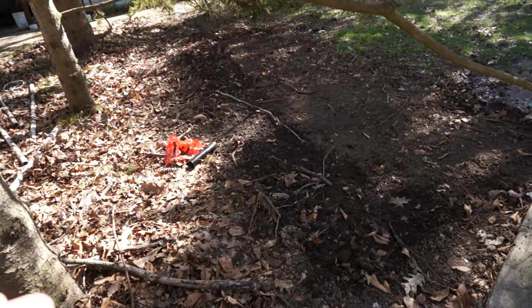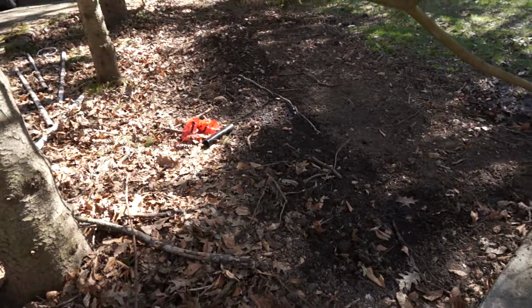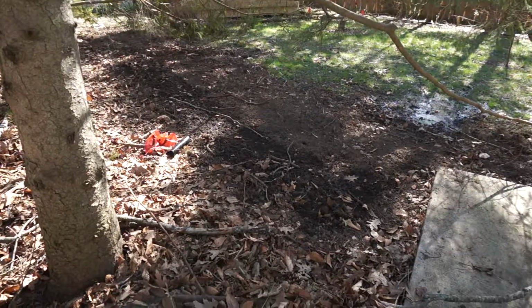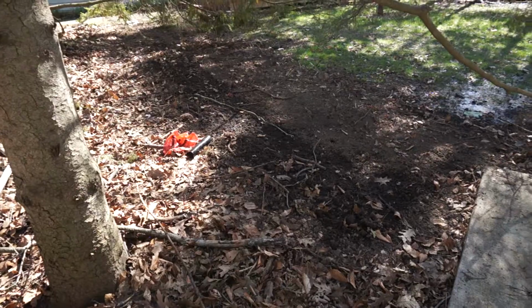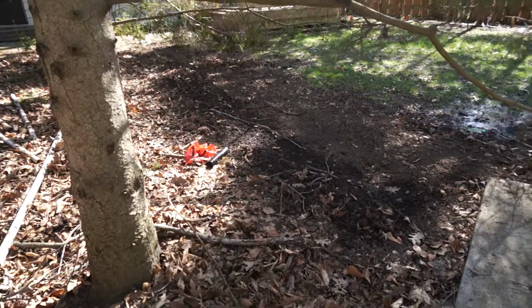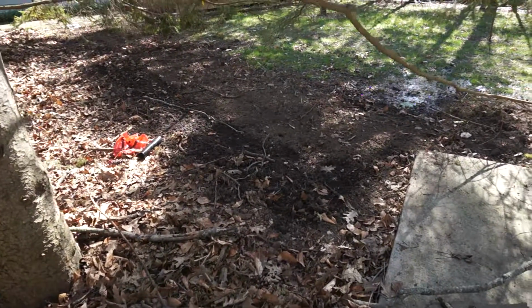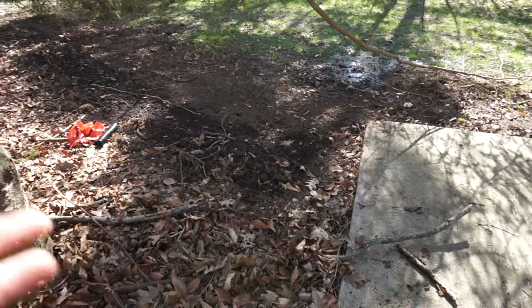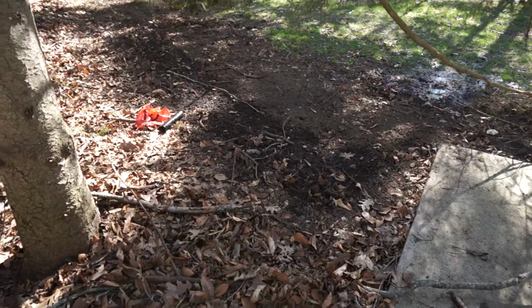so the tubing isn't buried as deep as I would like, and I've had issues in the past of getting heavy rains in January, February, and then my sump line is frozen, and then it has nowhere to go, and then I have to do a makeshift thing. So I'm going to have to figure out a way around that right now, because even though it's buried deeper than the original Schedule 40 that was there, it's still quite a bit of tubing.